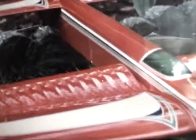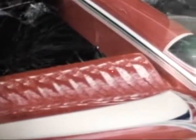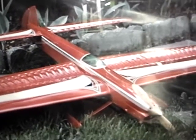Anyway, for people that may not go back all the way into the end of history here with our planes, this was our 86 plane. And I had made these flaps with what I call a spine method. It's similar to a Juno, the way Billy Werwidge builds, or built some of his planes. And I've seen other planes that are like this. Some of the European planes have the same look, but building off a spine, when you're making a spine rudder, like we've used on several planes, it gives you a lot of choices. Now, one of the choices is because the spine is always your center line, so it's almost impossible to get something crooked.